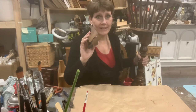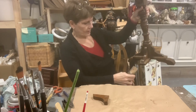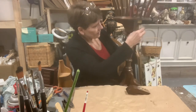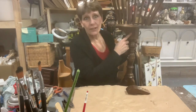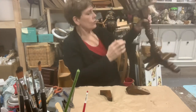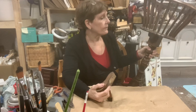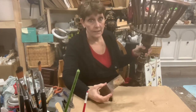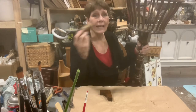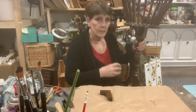Here are the other pieces to it. This piece goes on this leg down here, this way so that the nails attach. It goes on down here. This piece goes on over here. We're missing the two on the other sides, which will be okay. And there is water damage in here. So here's what we're going to do — we really have to get these pieces attached and fixed up. I am going to reattach these to the piece and add in some additional nails. I'm going to use a little bit of wood glue and a couple more nails to reattach them in place.